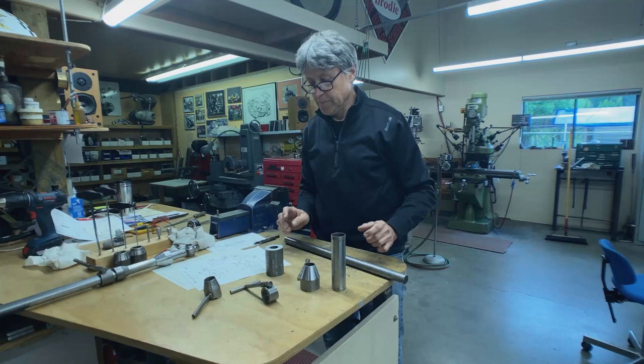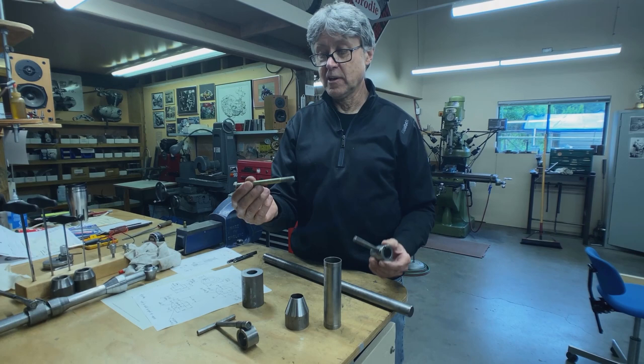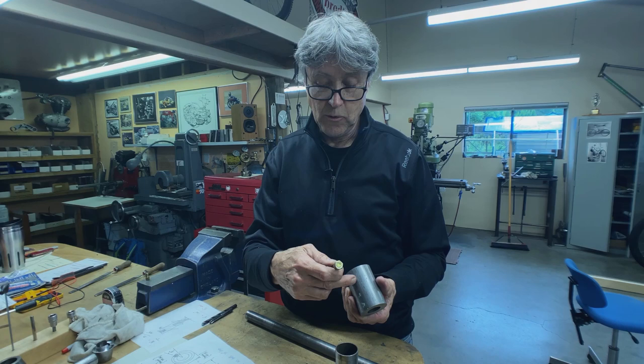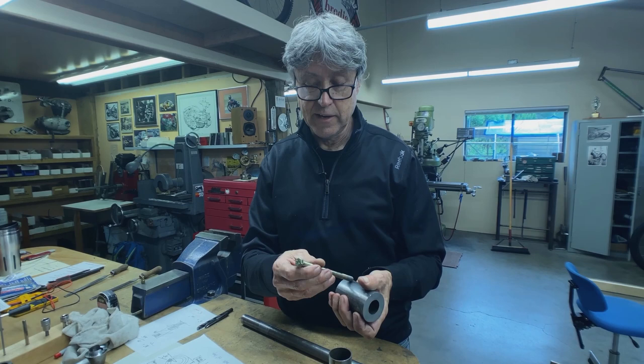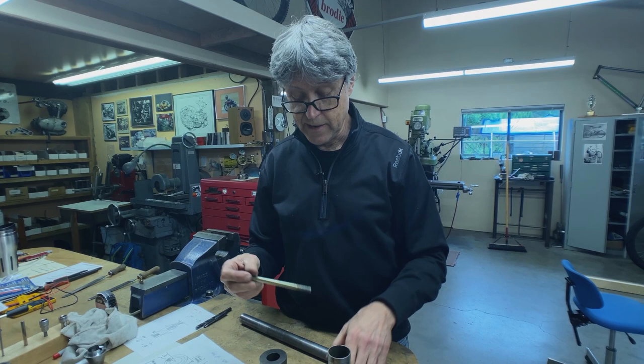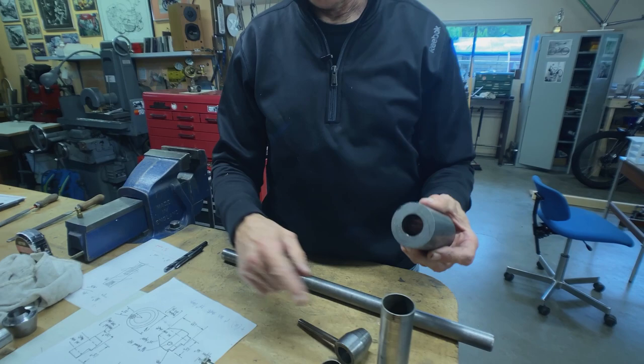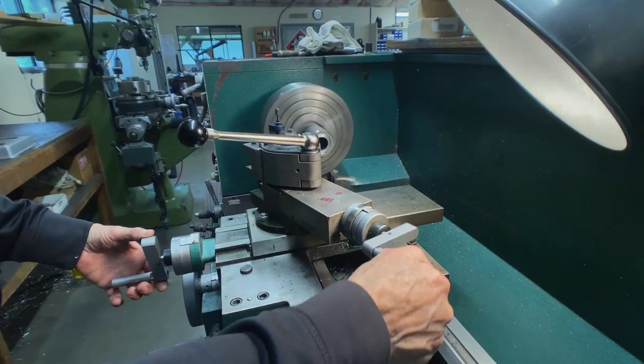That looks okay. It's not absolutely perfect, but it's smooth. I have to put a handle on it as well. For that, I've got a three-eighths bolt. So after we make the cone, we're going to put it in the mill, drill a hole, tap a thread, cut it off, Loctite it in there, make it really tight with the hex, and then cut it to length. That's basically how it's going to be on the larger one. So let's go back to the lathe — I have to do this whole process once again, but it doesn't take that long.